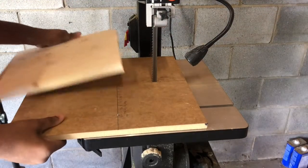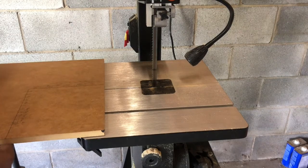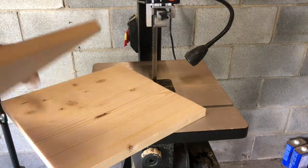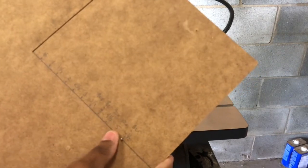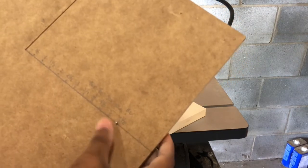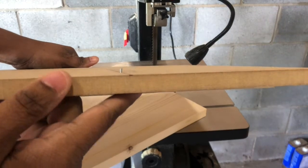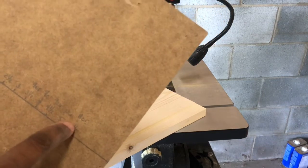Okay, what I have here is a jig, and I'll leave a link below of how I made this jig. It's a circle making jig, and it has measurements on here for the sizes, the half diameter mark of my circles. So for example, I have a little nail that I cut off the end of. Can you see that? It's right here. And I have it placed at the 5.5 mark, which would be half the diameter of the 11-inch circle.